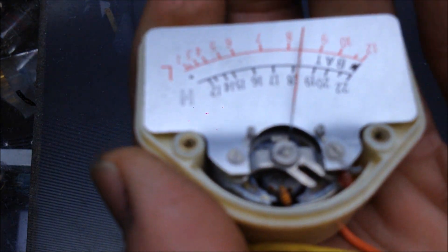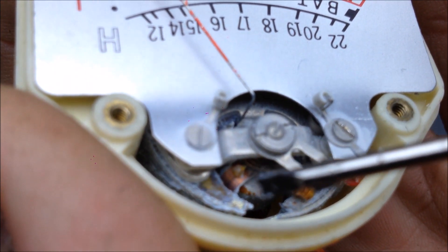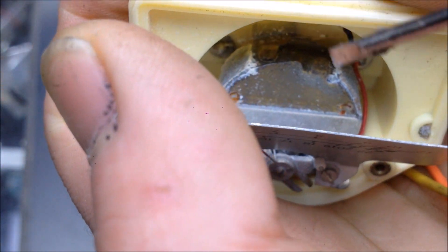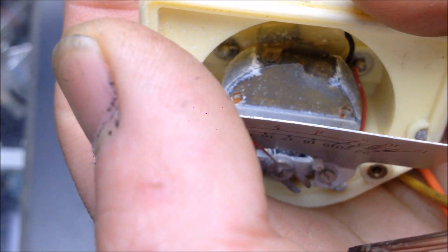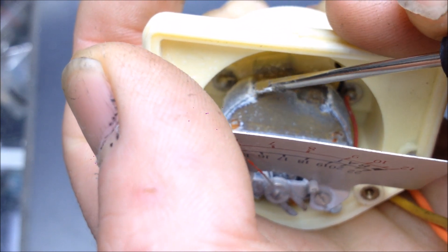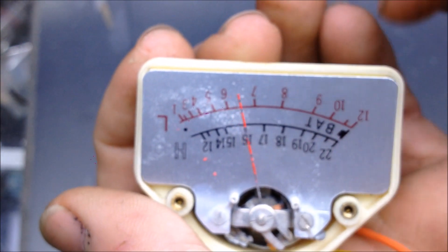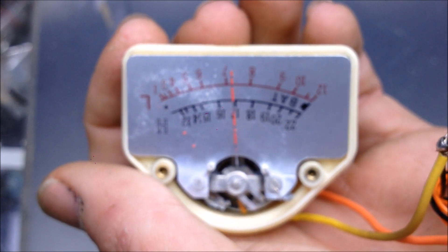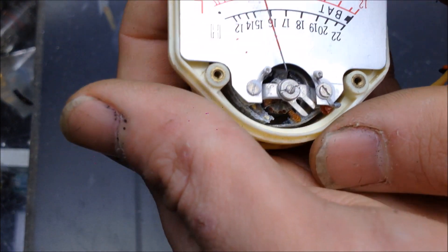How do these work? We have a little galvo here, and there are two parts to note. The first is the little electromagnetic coil right here, and the second is the permanent magnet assembly. Between these two points we have one north and one south. On the inside of the assembly we can see stacked laminants of steel that transfer the magnetic field to where the copper coil is, and between those points is a permanent magnet — I believe it's an iron magnet. Galvos got their name from scientist Luigi Galvani, who found that very small electrical signals put into frog legs would make them move.